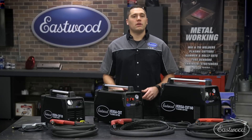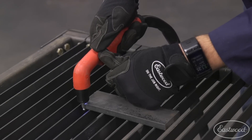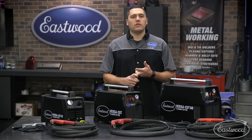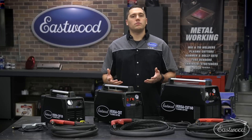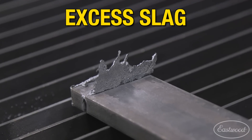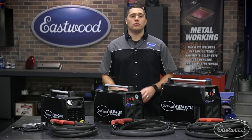Some of the technical difficulties you may stumble across with your plasma cutter are things such as arc quality. Some of these can include inconsistent arc, non-existent arc, or an arc which attempts to blow out the side of the consumables. Another symptom you may see in your work are poor cuts with excess slag or larger than normal cuts. Today, I'll cover tips which can solve these issues in a very short time.